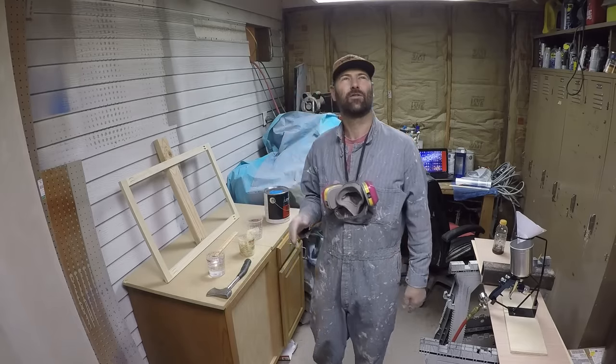I'm gonna do my last coat, kind of a flood coat. It's thinned down a bit. I gotta put it on and have just the right overlap so that it sheens up and wets out and there's no stipple on it.